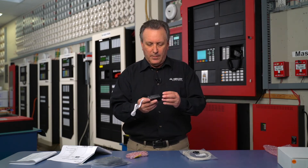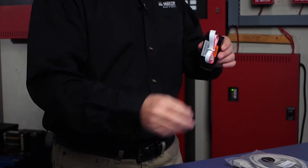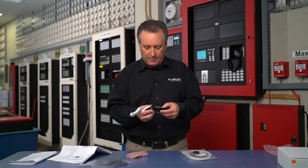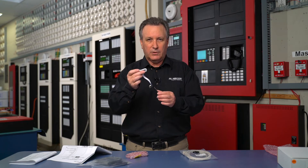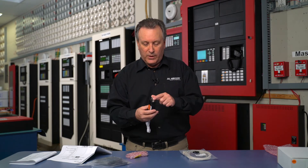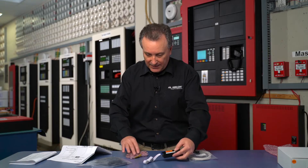Our previous UIMAs used to just connect to the panel with a serial cable. Now we connect the USB cable directly to the UIMA4 from our laptop. This gives us our 10-pin ribbon cable directly to our fire alarm control panels. We also have the ability to have an RS-232 port on the other side connected to our panels. That's the UIMA4.